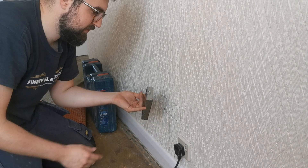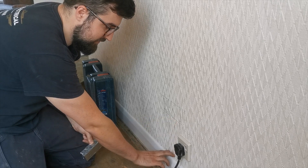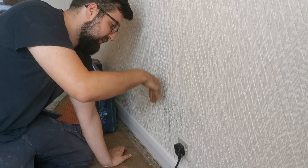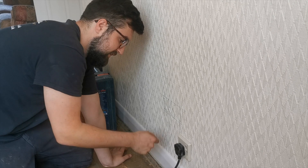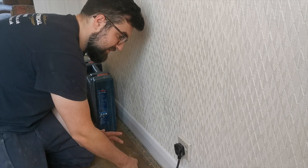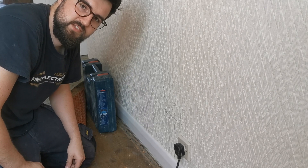Once that's done, we'll take two knockouts, put two grommets in, get it fixed, and chase from here down to the skirting boards. Then we'll use a 20mm or 16mm bit to drill down behind the skirting board without damaging it, into the floor below. When it comes to wiring, you bring the cable to that point, get your arm in, and fish the cables up the wall to the socket.